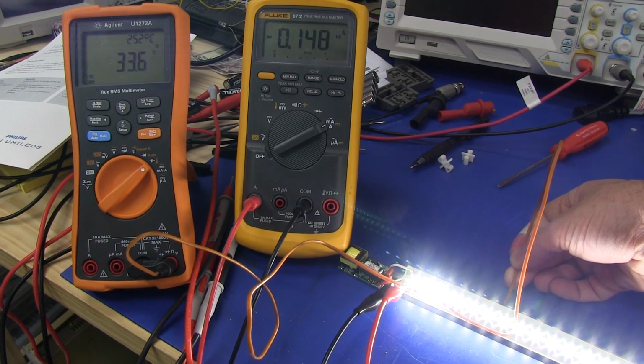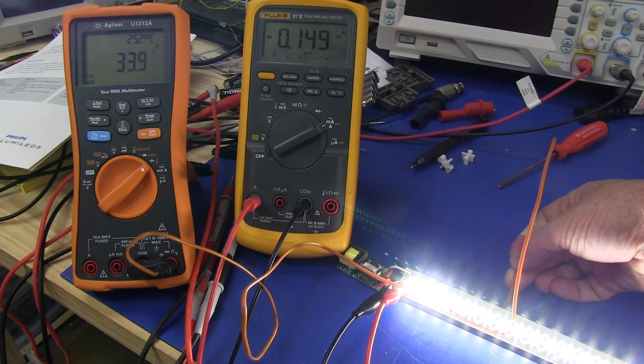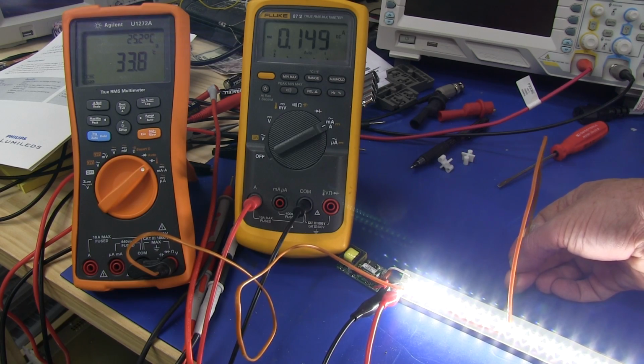Heatsink on the back, and as you can see, it's not as hot, of course, because the thermal bonding is, well, basically not there. It's just radiating through the FR4 onto that, but it is certainly well above ambient. And if you encase the whole thing in polycarb, I don't know, to do proper temperature measurements, you really got to do it inside the actual tube itself.